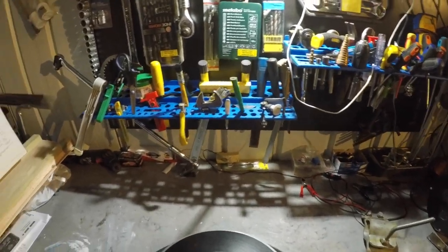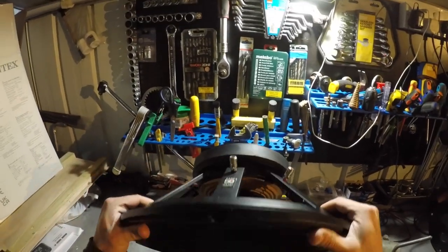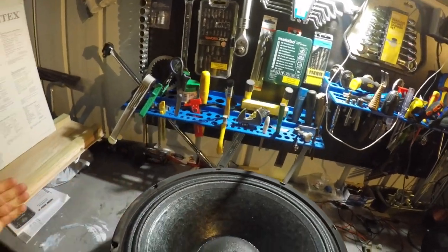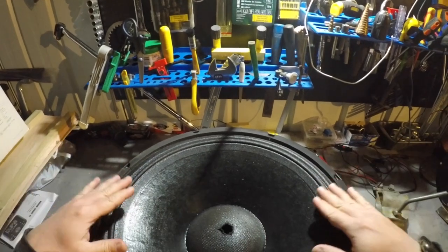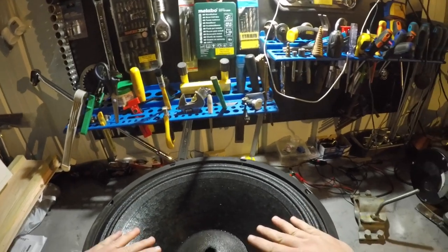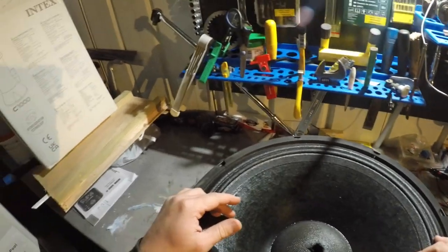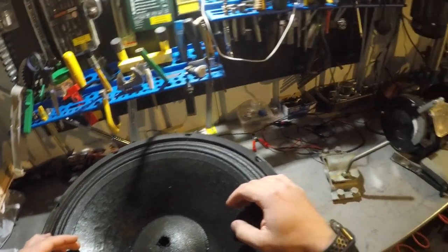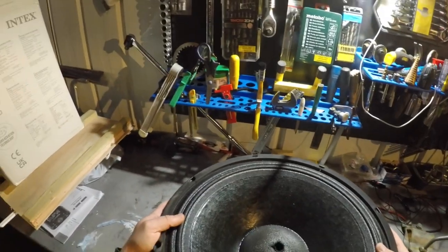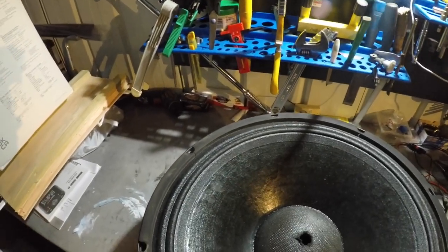The BR range comes from bass reflex, I think, because as opposed to the F218, which is the classic Funktion 1 bass bin with a scoop design, on the BR range you can see the driver. If you see the driver, that means they're short throw bass as opposed to long throw like the F218 or the other Fs. I love these bass bins, man. They're genius. What happened to this is a mystery, and I'll find out now when I strip the cone out.